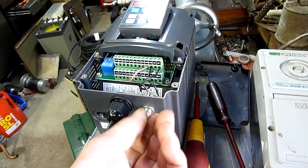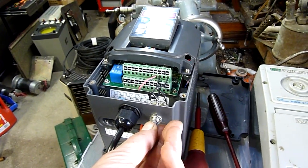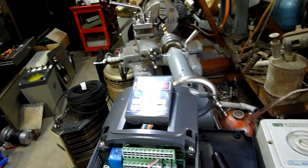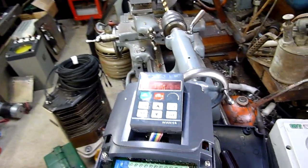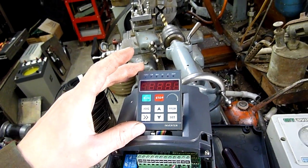We've got it partially working and there's still no response from the potentiometer, but I was able to program it to go flat out from 0 to 50 hertz. It tries to run but it doesn't. It sounds like the phases are crossing over each other, or out of phase, and it doesn't matter how I wire it — it just doesn't change anything.